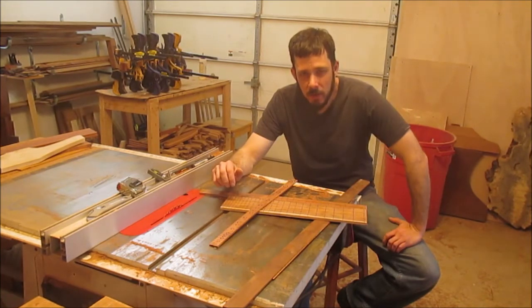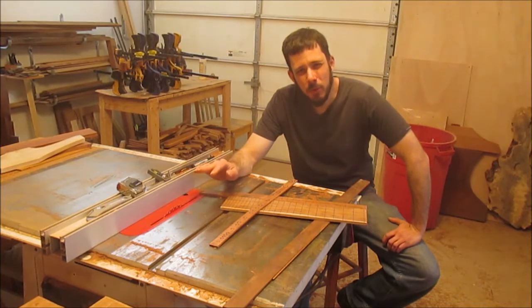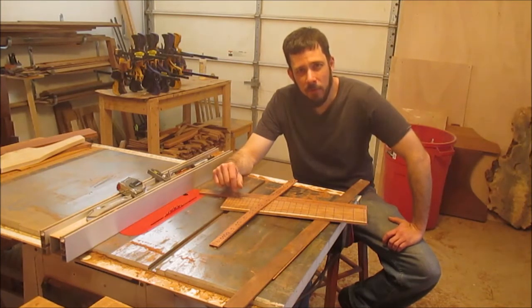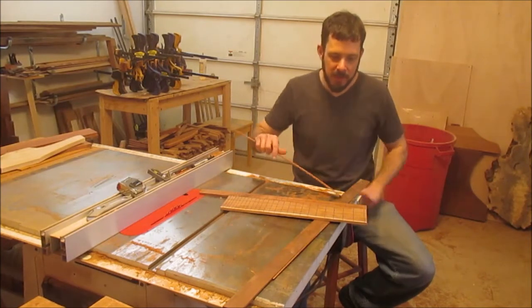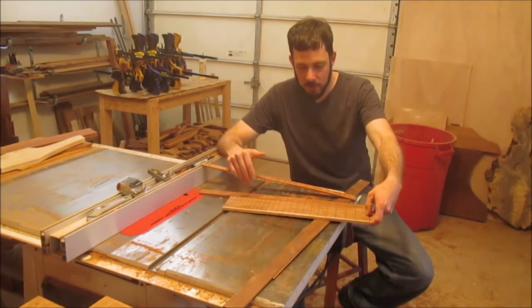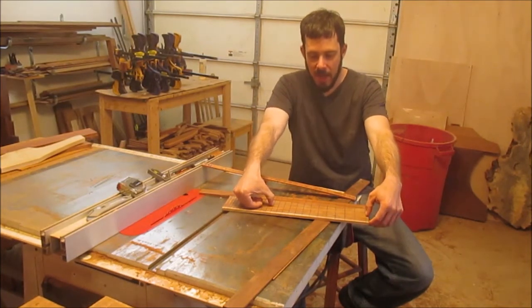Also, it's the case with tenor guitars that the 25 and a half inch scale length of the Fender lines up somewhere like maybe 22 and 3 quarters if you cut off the first 2 frets of a Fender guitar fretboard. So you can actually use that as a pre-cut fretboard for a tenor guitar. You'll have to check it to make sure, because I don't remember exactly, because I don't do it that way. But it's another way around it, and you should be able to pretty much find something to use for a tenor guitar fretboard just by figuring how long the scale length ought to be by measuring from the 0 fret or nut to the octave and doubling it.